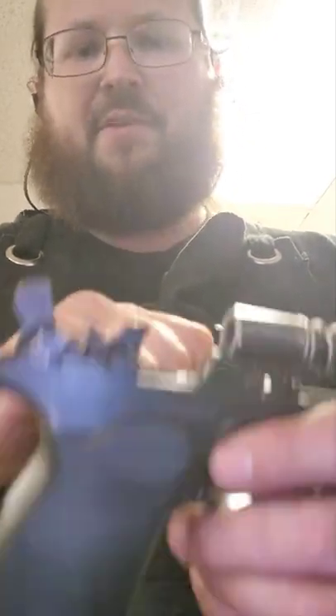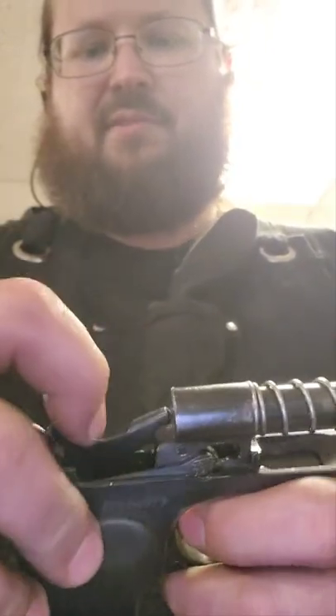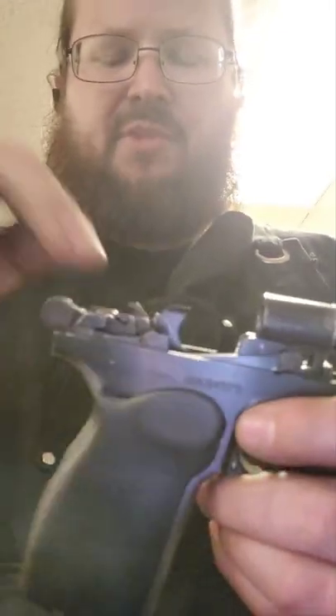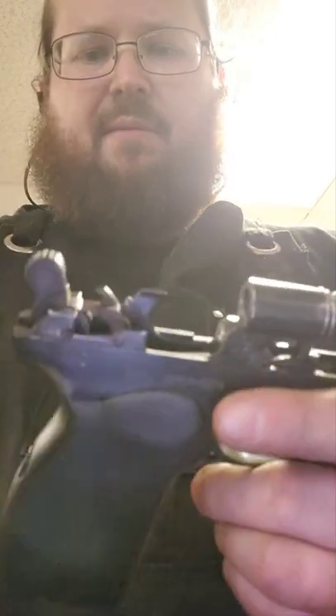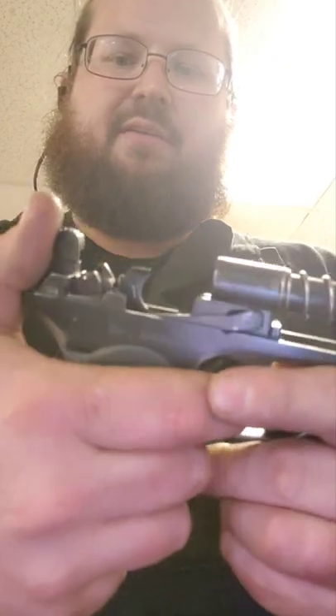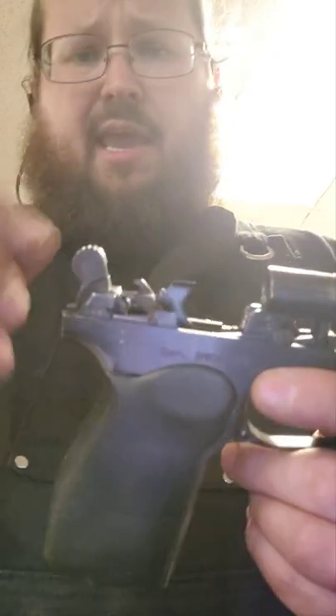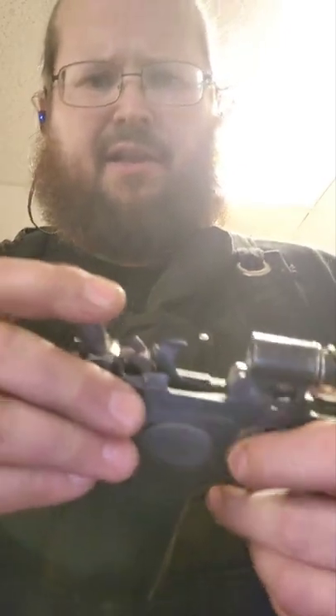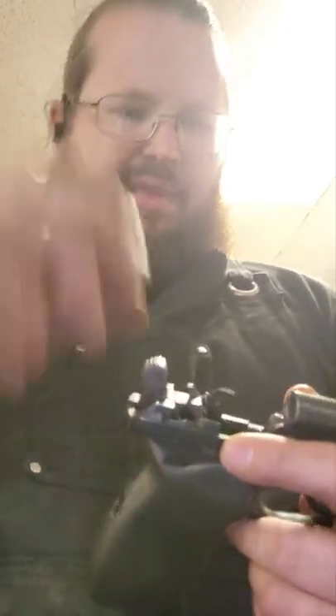There's not a lot of parts to it. The whole thing operates basically off of this one spring here — it works for the bolt stop, the ejector, and the sear spring. It's all one thing. And then the hammer spring is a double leaf spring: one for the actual hammer push weight, and the other is because the hammer, after you've pulled it, goes forward just a touch, and there's another spring that helps pop it back after that. Kind of like on the SIGs — they've got that little tiny thing to pop the hammer back in place.